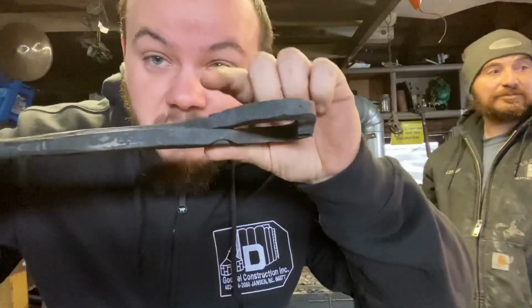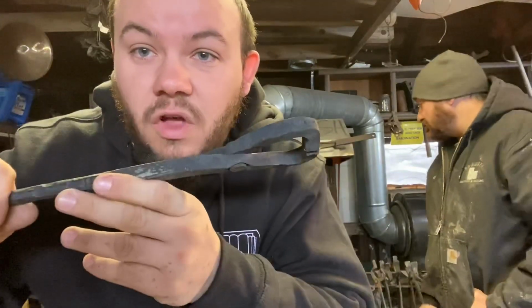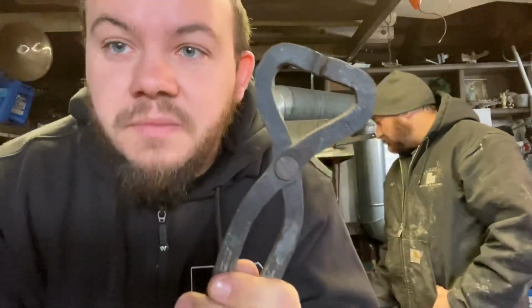And that's another advantage of having those divots, is if your rivet's too short, you might be able to smash down one side, but the other side you won't be able to even reach. And if your rivet's too long, you have plenty of cavity for that excess to fill up. And if your rivet bends over one way and you just aren't able to correct it, no big deal. Hammer it into that divot.